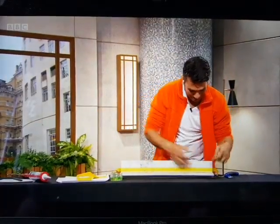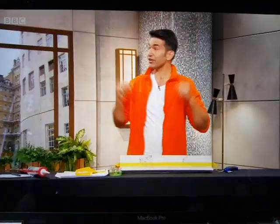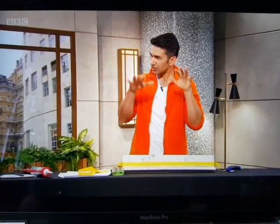Absolutely. So put some masking tape on. Make sure there's about, like I said, 1 centimetre gap. Do that all the way around. Make sure everything's totally dry. Next top tip, fill your bath. Because when you get in your bath, it's normally full of water, you're in it, so the weight of the bath makes it drop just to its lowest level.